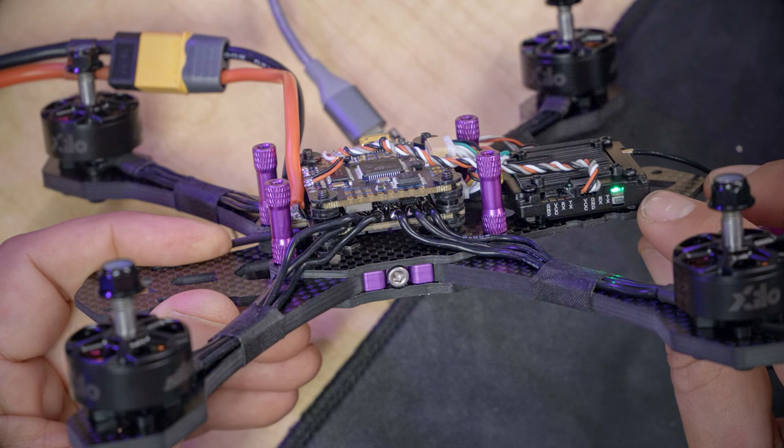Whatever you do though, absolutely you need battery voltage turned on at the very least so you can monitor your battery voltage. We'll talk more about that. Well, that might even be just a topic for a whole other video series, but it'll be like driving without your gas gauge. You won't know when your tank's about to be empty. And unlike your gas tank, when you run a battery empty, you destroy it.